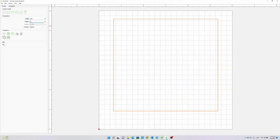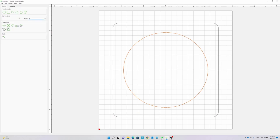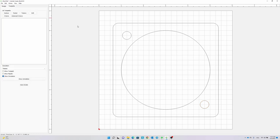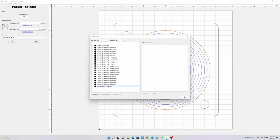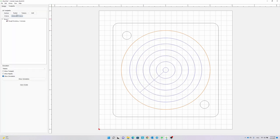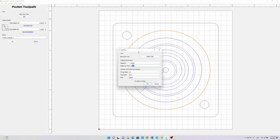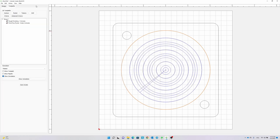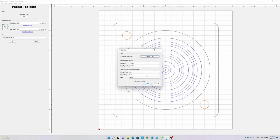The design of the top part is very similar to the bottom. Basically, there are 2 differences. First, the material thickness of the top is 1 inch compared to 1¼ inches for the bottom. Also, the radius of the big circle is 2 inches for the top, compared to 1.97 inches for the bottom. And that's because we don't want a snug fit for the top.